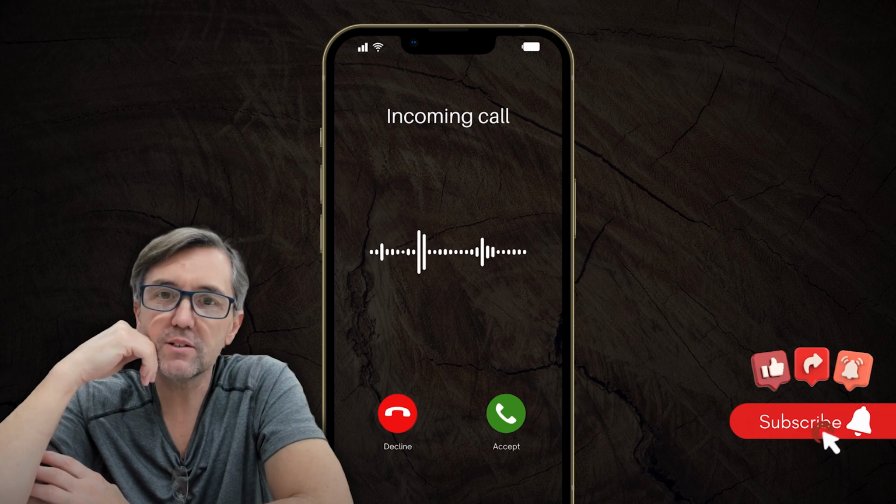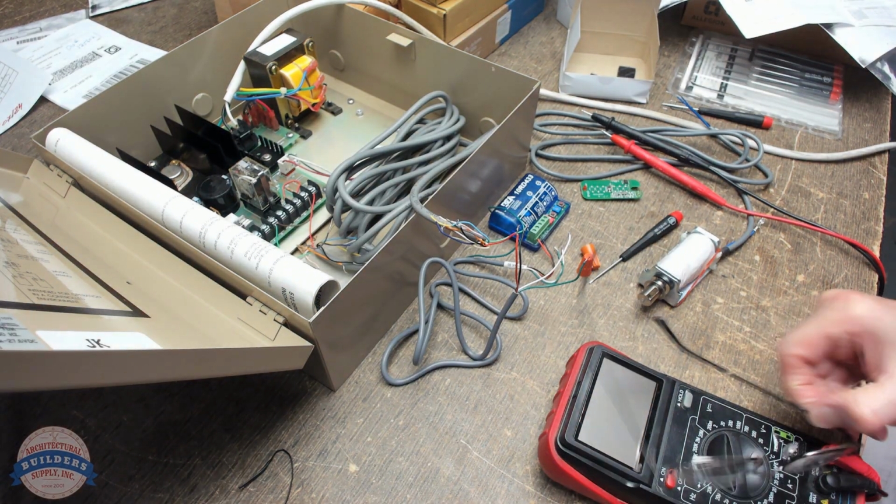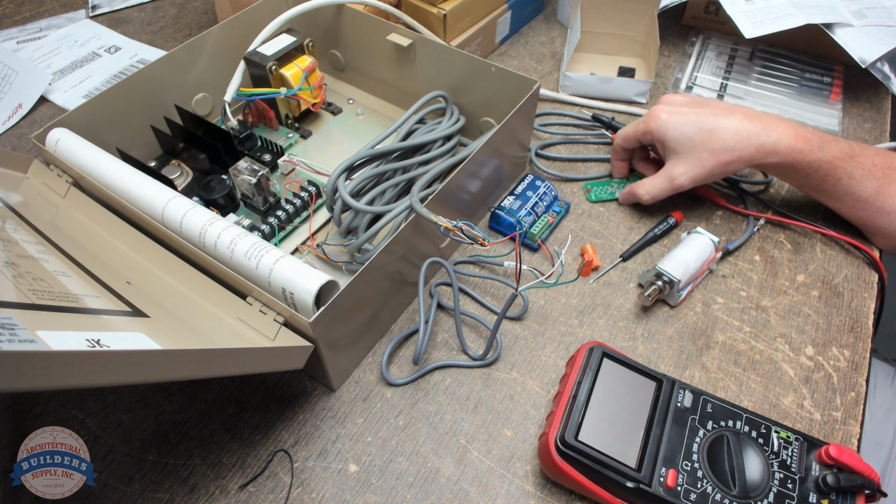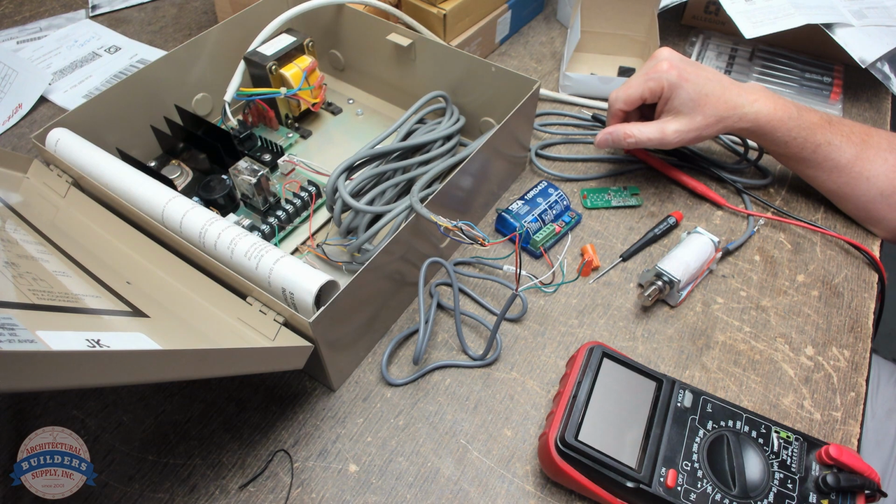Hi, this is Richard. Hi, Richard. This is Aaron with BEA Tech Support. How are you, sir? I'm doing good. What you got going on today? So I have a 10RD433, and I have a 10TD433. For some reason, I'm not getting voltage across common and normally open in either state of the receiver. I'm paired. I'm getting a blue light. But I don't know what I'm doing wrong.